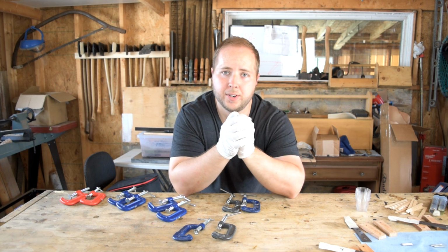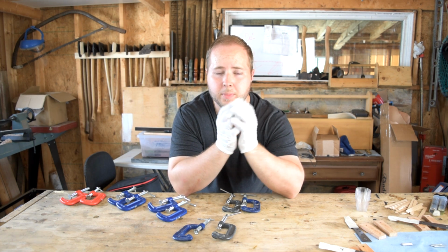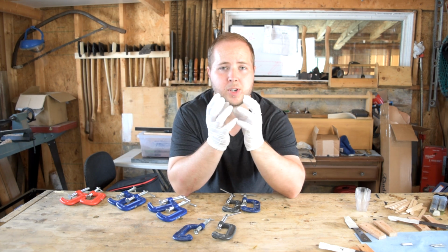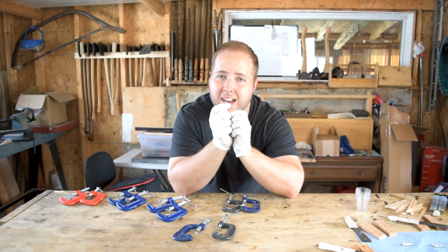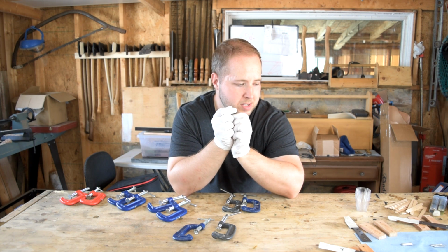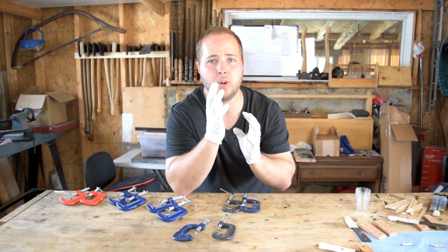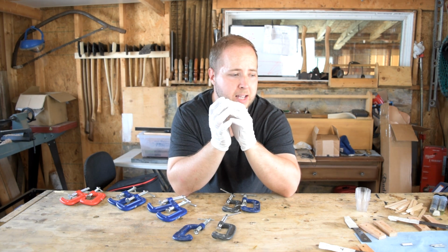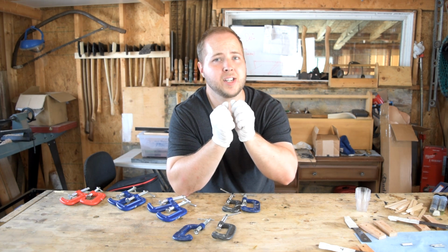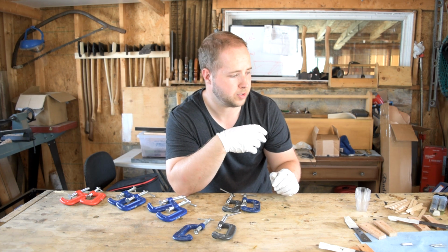but they're a little bit pliable when they're done, and I like using that when I'm using wood, because wood responds to its environment, temperature and moisture, so it changes the slightest amount. You'll notice these handles will be a hair different in the winter than they are this time of year, now in the summer. If you use a real rigid epoxy and you get that change from the wood, it could cause an issue. Something could break apart, or you could split the wood. But using an epoxy with a little bit of flex allows those scales to change just ever so slightly. So, little things you pick up over time.